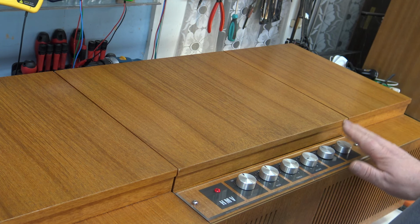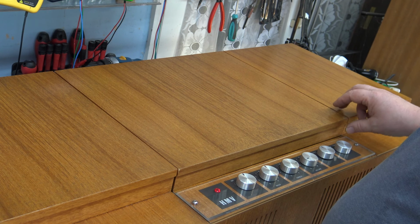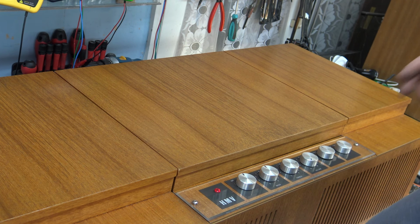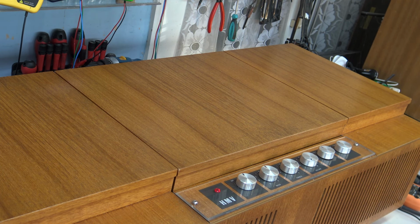These other controls are being manually cleaned, as you know how to strip it down. So I think that's sounding absolutely fab and brill. I'll let that play to the end and then it can do its auto stop. We're going to run quite a few. I'll put a stack of records on and we'll actually run it for about 12 hours. I need those lubricants to work in because I noticed it was still a little sluggish at that slower speed.